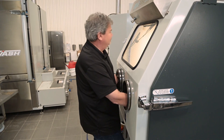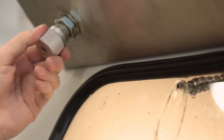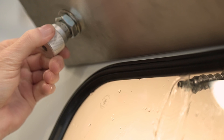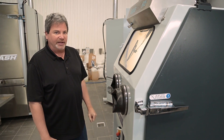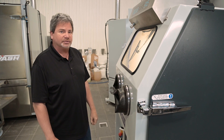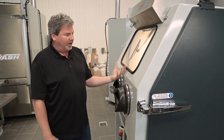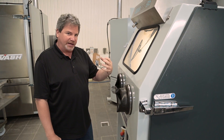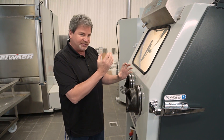Just a slow steady stream — that's going to use probably about a pint a minute, that's all. It doesn't take very much water to rinse the window. When you're blasting parts, make sure that you're not letting the water come out of a cavity and back onto the window — that's really an operator technique. You want to blast away from yourself, making sure that everything is deflecting and washing away, which is going to keep your window cleaner.